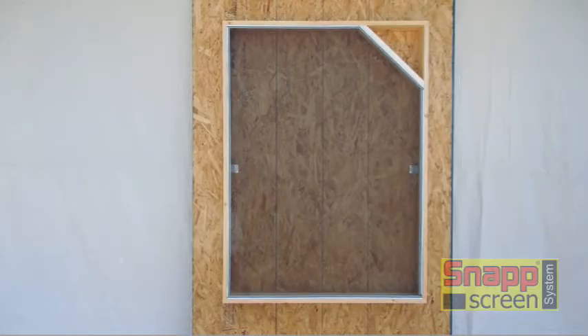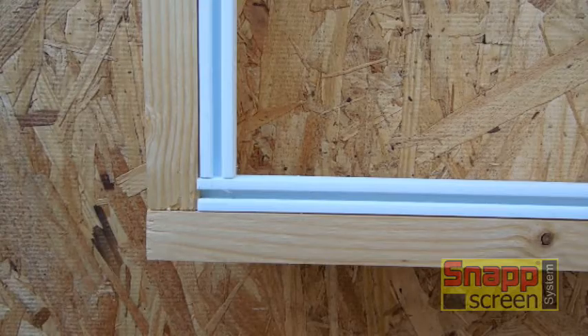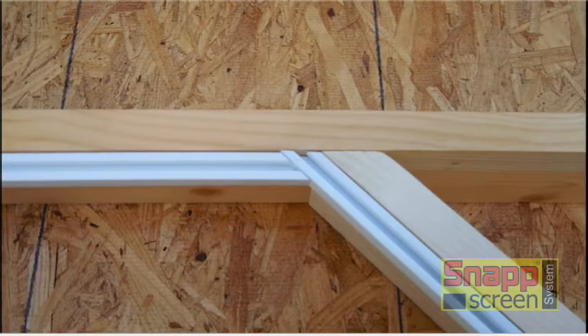We've set up our mock opening with a fifth side. This shape is actually pretty common in a lot of porches. As far as the snap extrusion goes, your corners are set up exactly as we've shown in other videos. If you wanted to miter these you could, but in this case we're just going to do the butt connection. Where people tend to get confused is up top with the fifth side — you're going to do the exact same thing as the other corners, except you're going to angle the extrusion so everything fits together nicely, and of course leave your gaps as instructed prior.